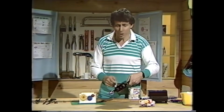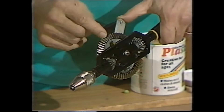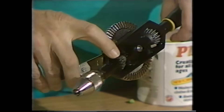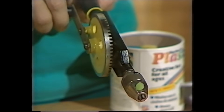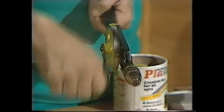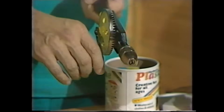Have a look in the back shed — you might find one of these: a hand drill. I actually counted the number of cogs on this big wheel here: 64. The number of cogs in the small wheel: 16. So when the big wheel goes around once, the little one goes around four times. You can see that effect if I put something on the little one — that's the part where the drill bit goes in. Now when I turn the handle around once, that'll go around one, two, three, four times. However rapidly I turn the handle, the drill bit will turn around at four times that speed — fast enough, in fact, to drill through wood.